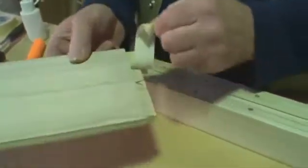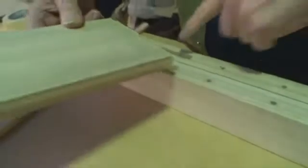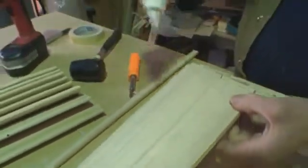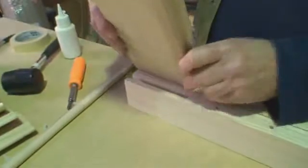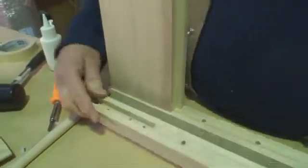Now that your shutters are painted or stained, it's time for the assembly. The first thing we do is remove the masking tape that we put on there to reveal the number, and to know that there's no additional paint on there, to ensure that it will in fact fit back in here. We then take our glue that we've provided, just a thin stripe on either side, and you'll know that's lining up the numbers. That will of course fit back in there beautifully.